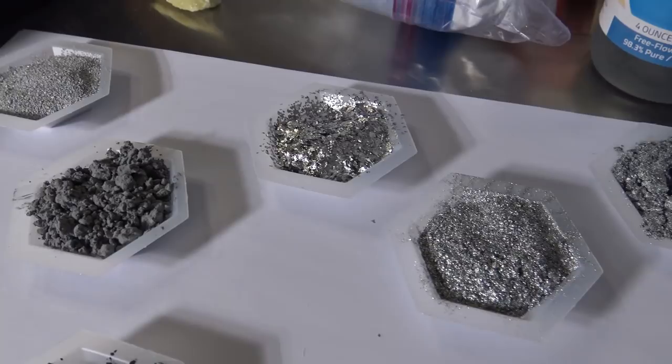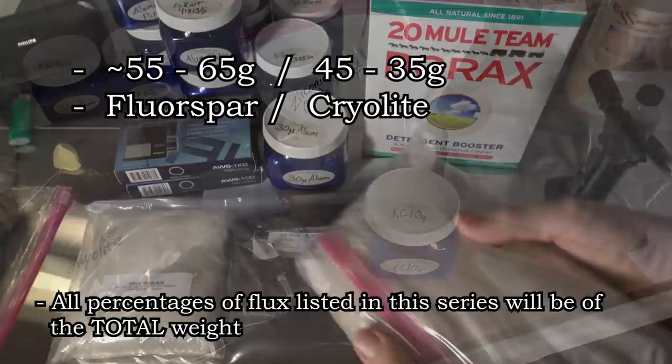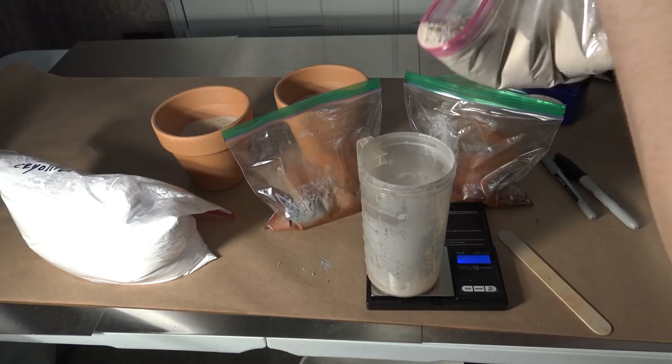Now, there are a few different types of commonly available flux you can use, like borax, cryolite, fluorspar, or even some of the more expensive refractory silicates. I've found, though, that the best and cheapest results come from a roughly 60-40 mix of fluorspar and cryolite. This mix also has the advantage of remaining relatively inert while absorbing the heat from the reaction and simultaneously lowering the melting point of the metal. Each reaction will need a different amount of flux, though, so it's always important to start with the smallest test